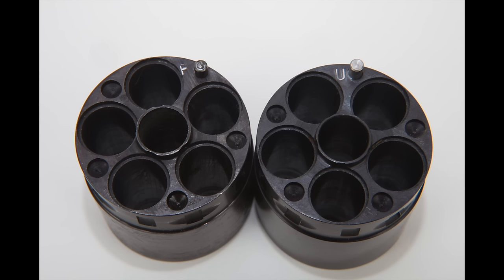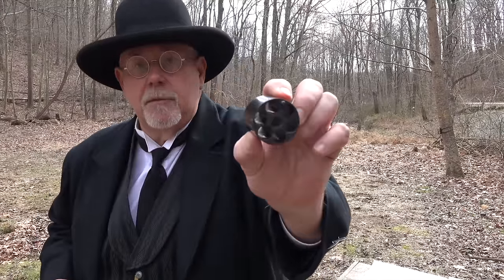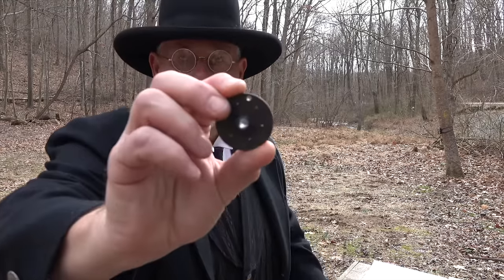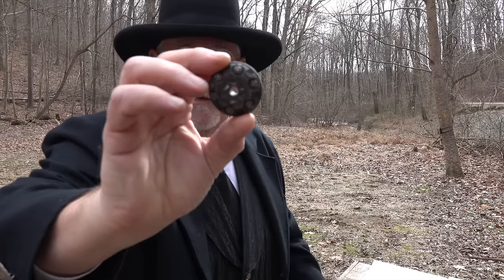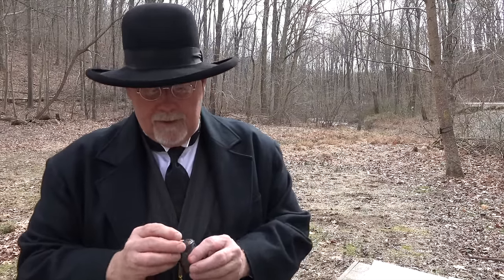All of the cylinders — the Remington, Ruger, and Rogers and Spencer cylinders — are appropriately marked on the face of the cylinder. Taylor's cylinders are two-piece cylinders: there's the main cylinder body which is bored through, and then there's a backing plate which has six firing pins on it. This is a historic design. Remington came out with this in the very late 1860s. The originals were different in only one respect — they were made for rimfire calibers, so instead of individual firing pins like this backplate has, they had slots cut through them so the hammer could contact the rim of the rimfire cartridge and set it off. But this is a fully historic design and it works quite simply.